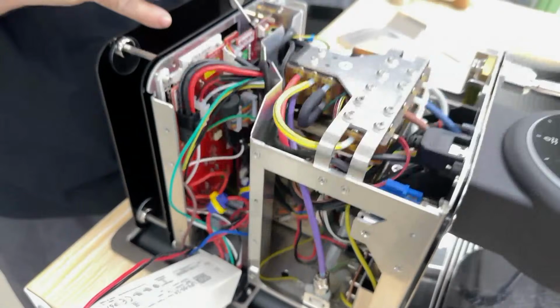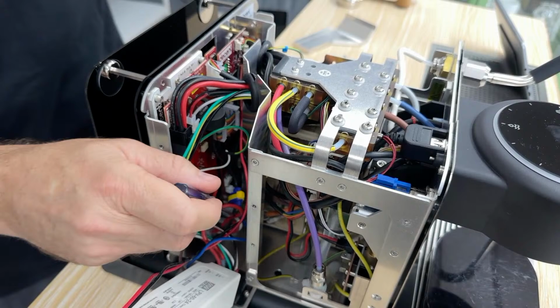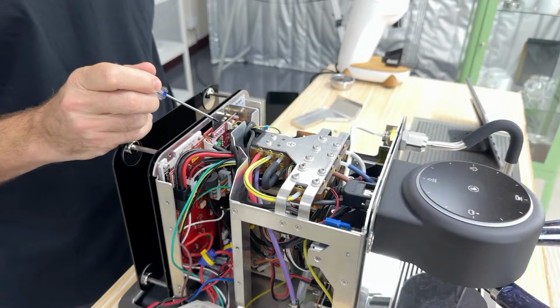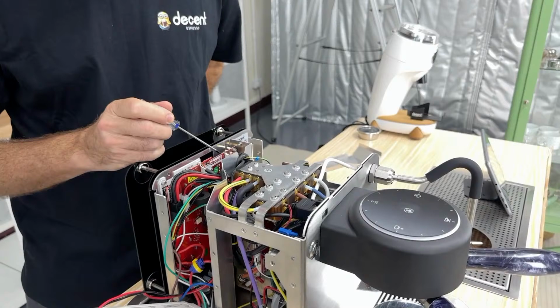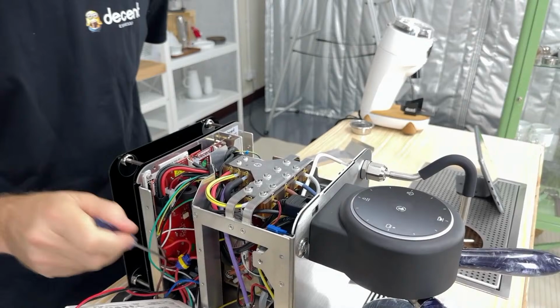The computer then says, is everything okay? And if everything is okay, it then sends power back to a solenoid there that engages AC power. Now that is a safety precaution because this is running a lot of software. And if the software does anything weird, like crash, for example, this has essentially a little dead man switch on it. So if the software here ever were to crash, the power is instantly cut. That CPU has to send out a pulse constantly in order to keep that power on.